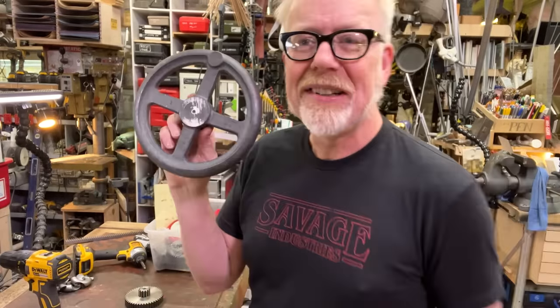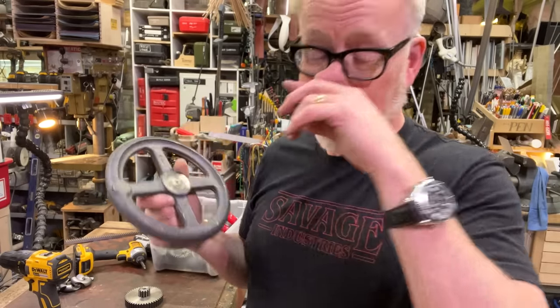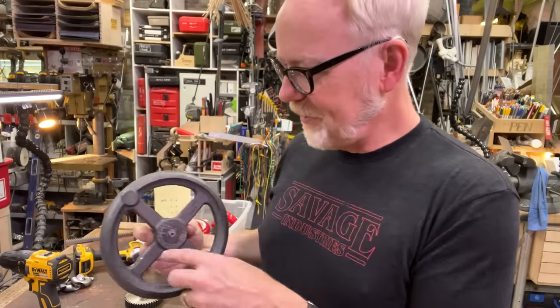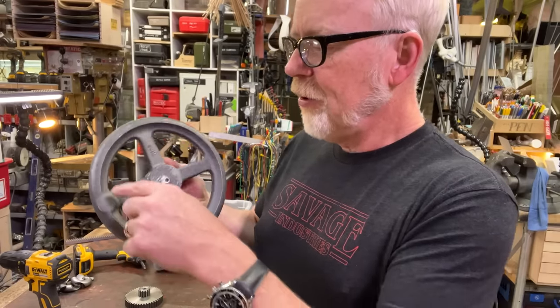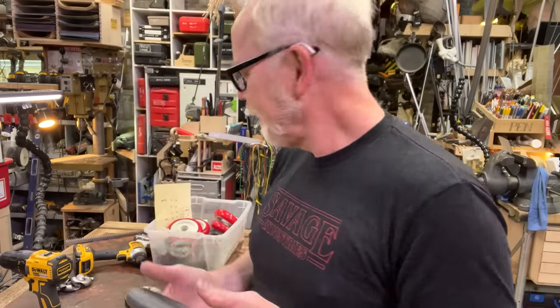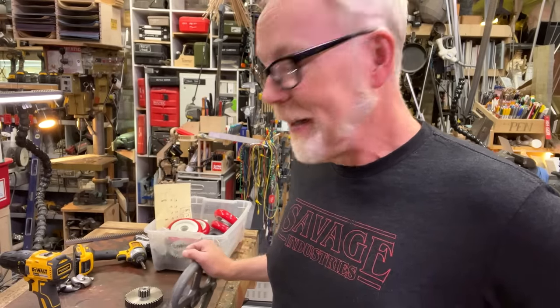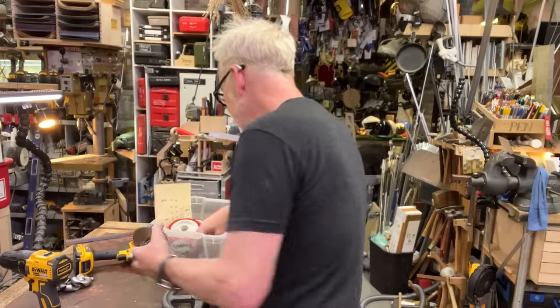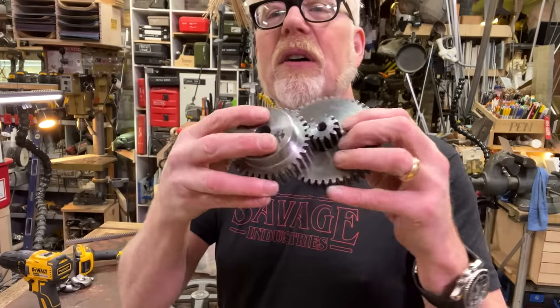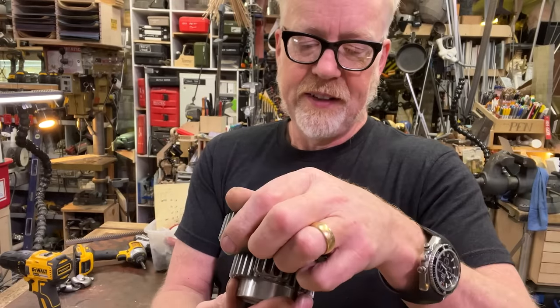Then I'm actually going to take this because I think it makes sense to balance it. I'm going to build a crude wheel balancing system here and try and just drill some holes in here and get this so that it's reasonably well balanced. Once I've done that, then it will be roughly time to start depthing these gears. And by depthing, I mean working out what the hole placements are